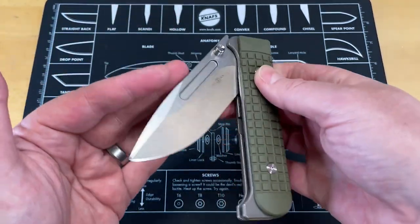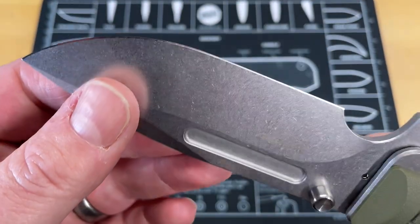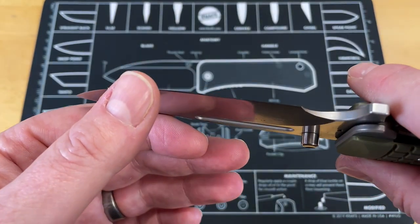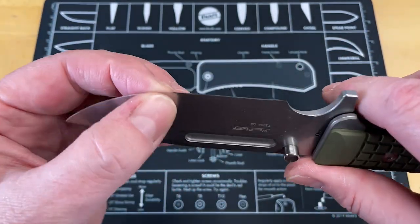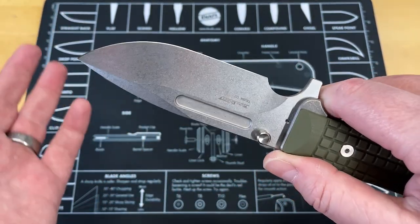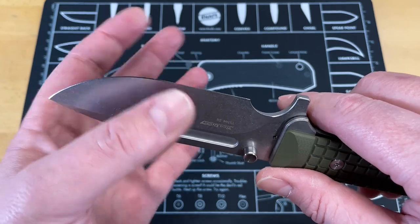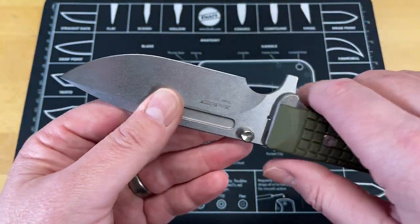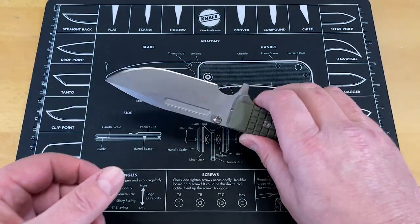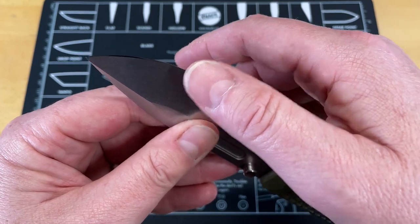The next issue is kind of a big deal. I don't know if it was heat treat or just how this knife was ground, but it did not seem to want to hold the edge the way I wanted it to. I had to touch this up way more often than I was expecting to. It did continue to slice because it's got really good blade geometry — very thin behind the edge — but it got dull pretty quick. I think it's because it's so thin that maybe if I had done a different edge angle, given it a little more steep angle as opposed to a thin angle, it would have held up better, but then it might not have sliced as well. Right now it just really doesn't feel all that sharp, but in its defense, I did cut up a lot of cardboard.